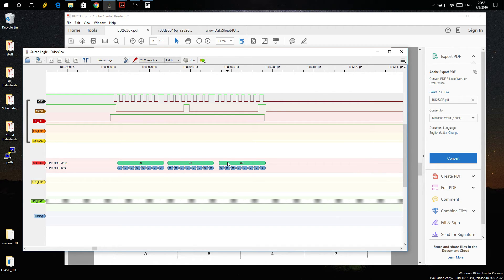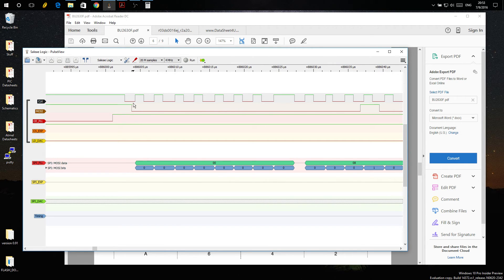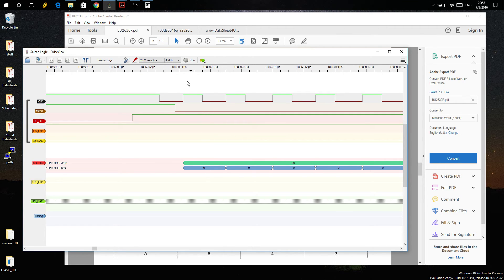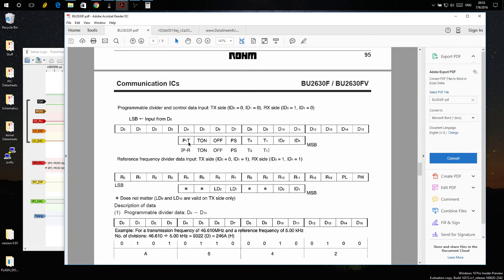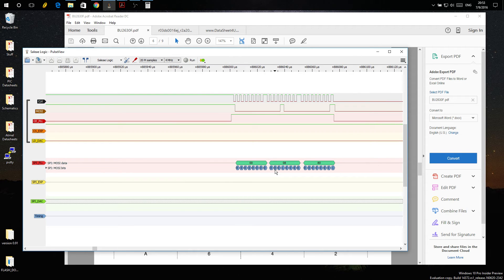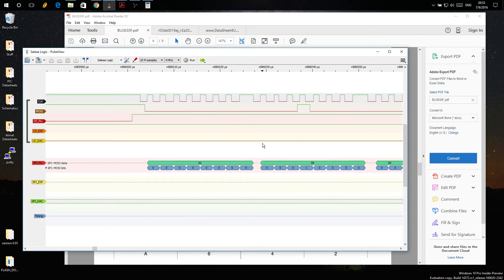The timing confusion might be how the microcontroller is sending the data — it's just a little bit wonky, possibly due to bit-banging in that MCU. Looking at the waveform, the start timing may be a little off, which is what I suspect is confusing the decoder. You can't really set anything in PulseView to adjust start timings. For what it is, it works just fine as long as you know there could be a quirk like that, and you can pretty much see it there anyway.